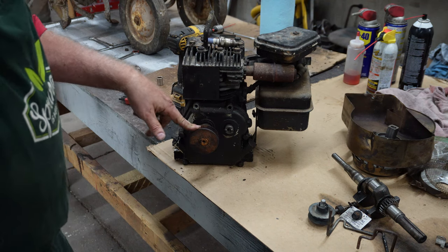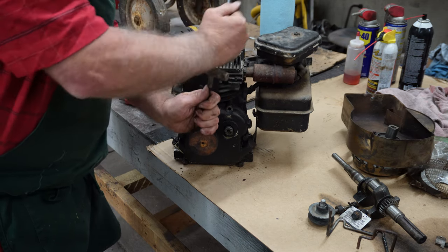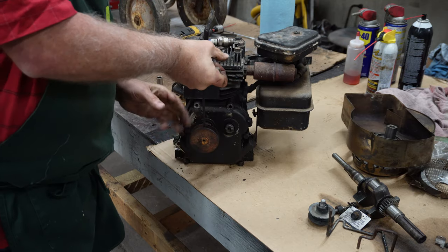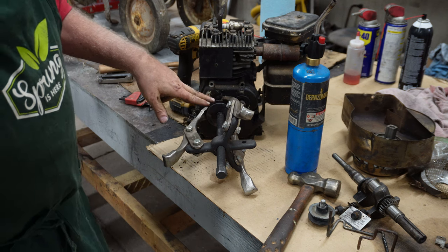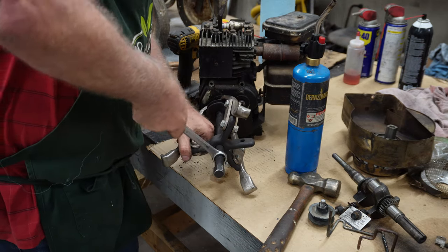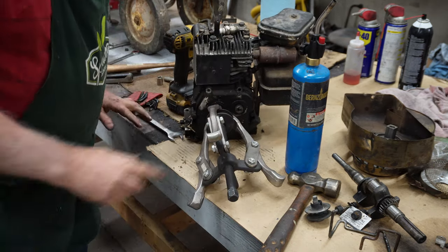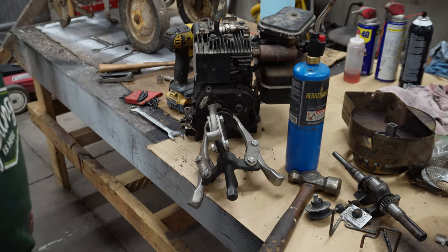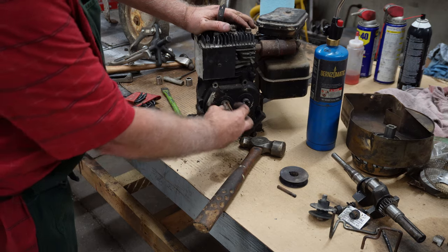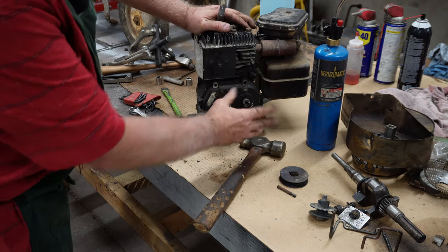There's an Allen set screw down in the groove of this pulley and I think I have the right size Allen wrench. Let's see if that will break loose — it's a little tight. I was able to get the set screw out, but the pulley's on there pretty tight. So I've got a gear puller on there — yeah, it's moving, that is going to work. I was able to run that pulley right off. Had a little heat on it, pulled it right off the shaft. Now this shaft is a little hot so I'm not going to put a lot of pressure on it with my hands.